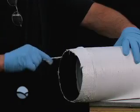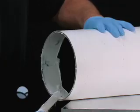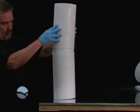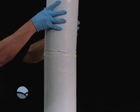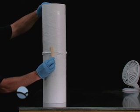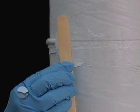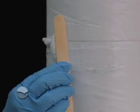Apply putty mix over the remaining outer surface area of the beaded slip collar and to the inside surface of the adjoining duct, and slide the adjoining duct fitting over the collar until the end hits the bead of the beaded slip collar. Smooth the outside surface so the putty is even with the adjoining duct outer surfaces.